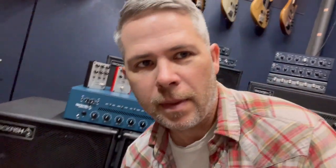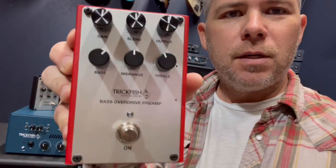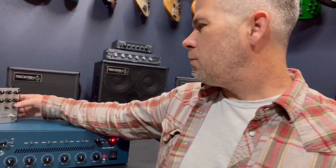Next one we worked on was the Bass Overdrive Preamp. It's a soft clipping overdrive with gain and output level along with a dry blend, allowing you to bring your dry signal in next to your overdriven signal. That signal then passes through a three-band EQ allowing you to shape that overdrive — bass, mid, and treble. A really cool unique feature on this one is the effects loop built into the circuit, so adding things like a delay, reverb, or chorus that you want to be part of your overdrive sound — when you turn this overdrive on and off, that pedal will be live in the circuit and part of your overall overdrive sound.